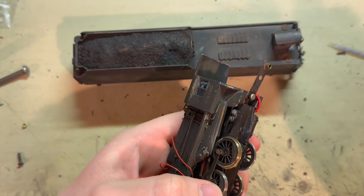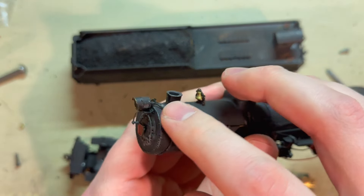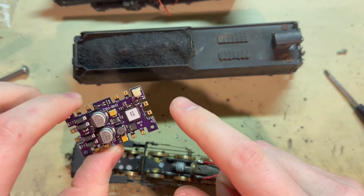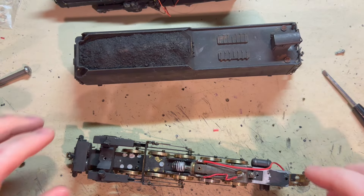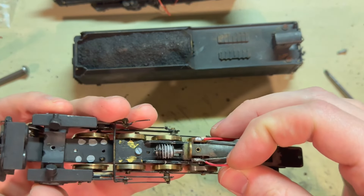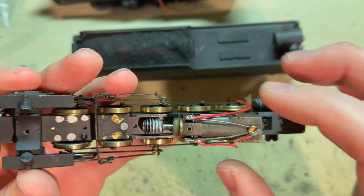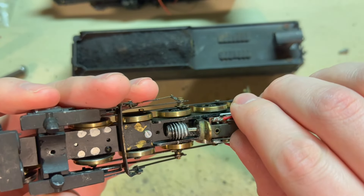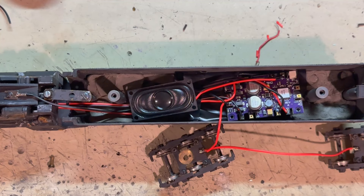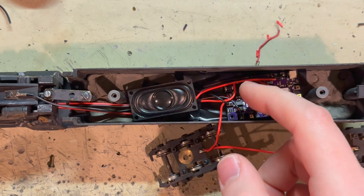I just need to figure out the wiring on here and get things started. But before I do that, I also need to isolate the motor. The headlight that's installed in here is a 1.5 volt bulb, which actually works perfectly with this decoder, which is designed to work with 1.5 volt bulbs and LEDs — so no need for resistors. As for isolating the motor, that's actually pretty easy to do on a motor like this. The brush plate itself is already an insulated piece, so all I need to do is remove this wire that was put in there and just stick a piece of insulation onto the spring here. And with that done, the motor will be completely isolated for DCC.